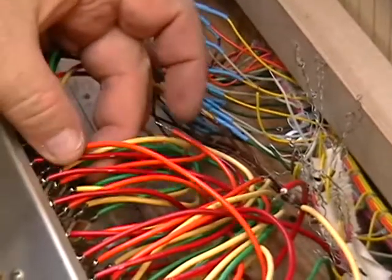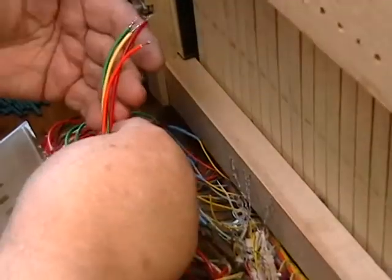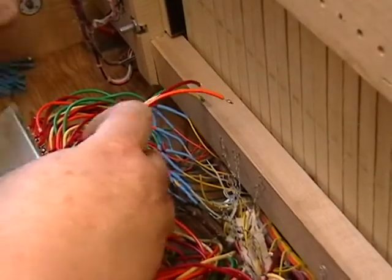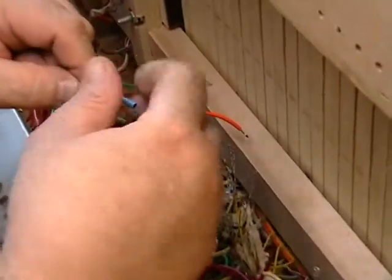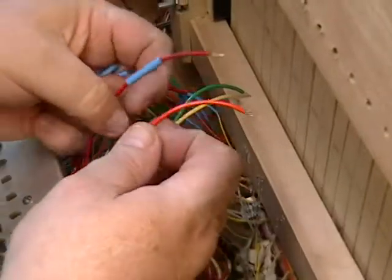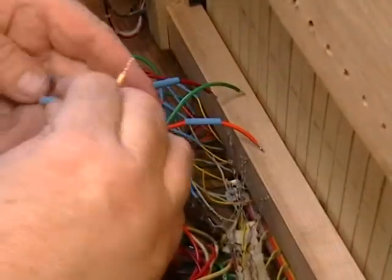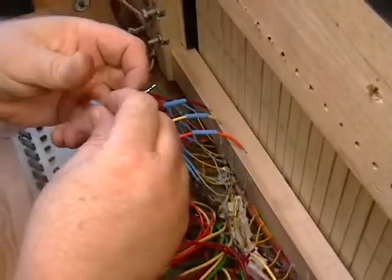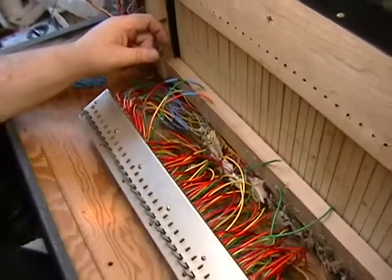Take number 9, which is this group right here. In an earlier section of this video, you saw us putting these wires on. And again, this was done in stages because we wanted to make sure it was done properly and nothing else was wrong. And you slip the sleeving on first. You don't want to forget to put the sleeving on, because otherwise you'll have to take it apart and do it again. These are short pieces of sleeving, just big enough to cover the splice. And of course provide a little insulation on each end. This is so they don't touch, and in this case they're also weatherproof, or at least to a degree.